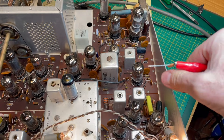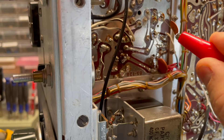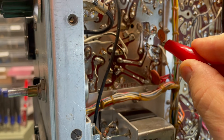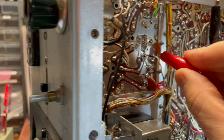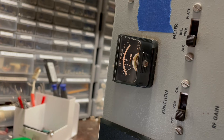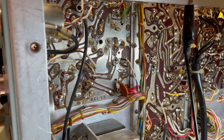Let's go to V4. I'm going to turn the rig on its side. Okay, this is pin one. I'm touching it and I don't hear anything — barely. Let's look at the S-meter. There's nothing happening at V4. That is why we do signal tracing.